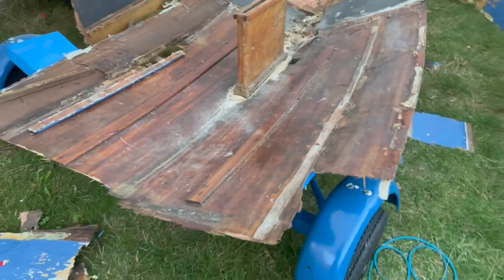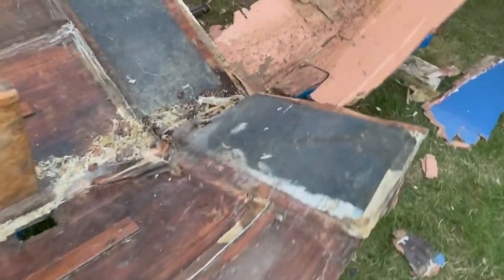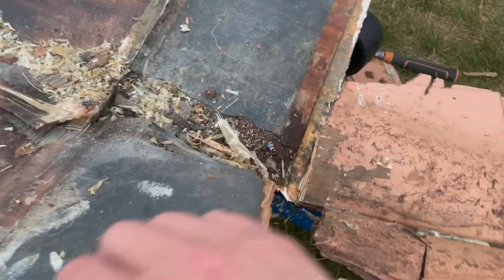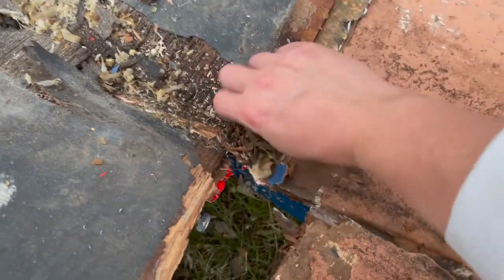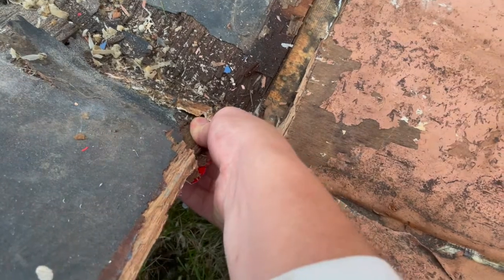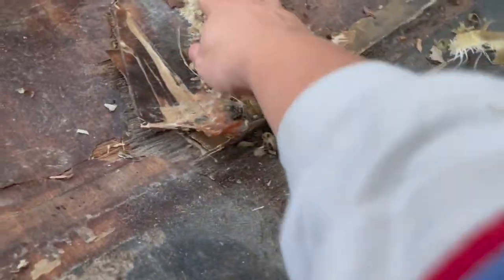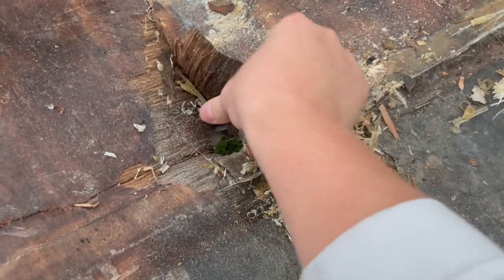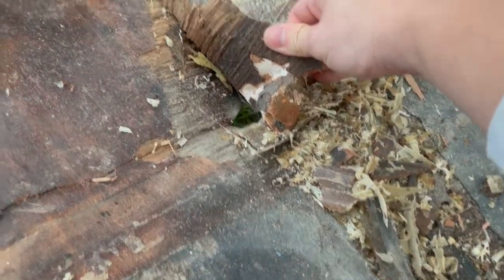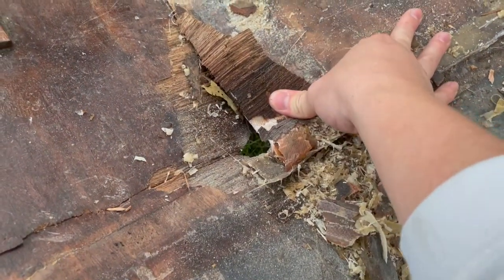The floor of the dinghy is just... wow, what a mess. You can see most of the damage down here where the water sits when it's in storage. You can see the hull panels have just completely rotted through — there is just nothing there. This bit has been fiberglassed over nicely, but when you pull out under it, that's what happens. Moisture gets trapped under the epoxy — it looks great but it's totally rotten.